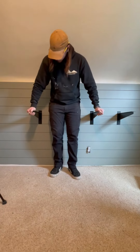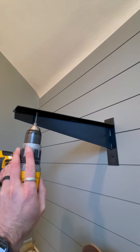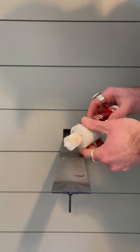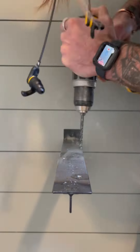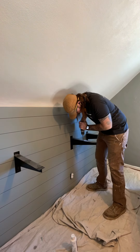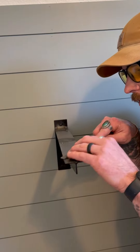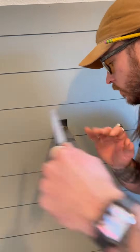Naturally when I install brackets like this I gotta give it the old test run. It's been a while since I completed this install, so I can't recall if they were half-inch or three-eighths bolts, but here I'm drilling pilot holes for the lags going into the bottom of the slab. Pre-drilled with about an eighth-inch pilot bit and then whatever that is — maybe a quarter or three-eighths hole — drilled down from the top with a little oil, then double-checked to make sure the lag fits through. After pre-drilling all the holes I took a flat file to the top to make sure there were no burrs that would prevent the slab from sitting flat down onto those brackets.